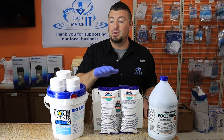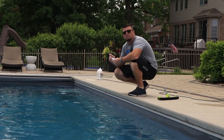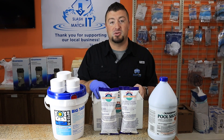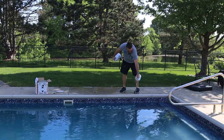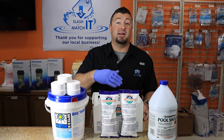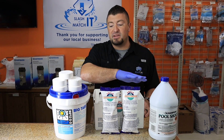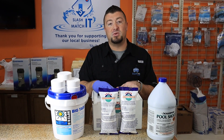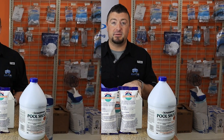The goal is to shock and disinfect the pool, bring in your tablets, and help chlorine fall gradually over seven days — making it through the week perfectly. Along with that, you'll want to test this approach since each pool is a little different. Go in two to three times a week, strip your water, and bring it into a professional pool lab. We love using liquid chlorine here. Technically it is bleach, but at a professional pool store you'll get 12.5% strength, compared to a Clorox or generic bleach which is only about 3%. So it is important to go to your local pool store for full-strength product. The target range for chlorine is one to three PPM when the water is clear.